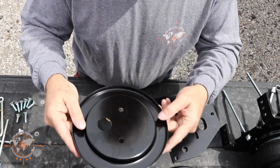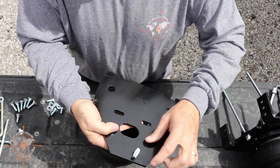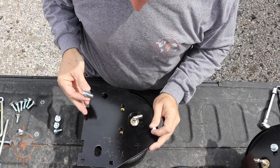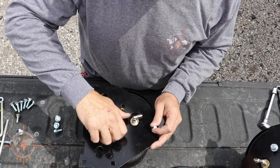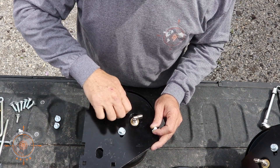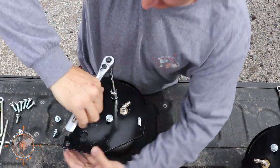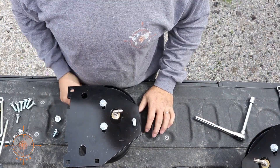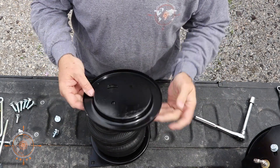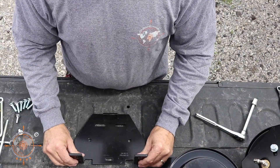We're going to add this plate, then add a hex bolt. We've got our carriage bolt — we're going to line these up with the holes and add our fine-threaded bolts. Now this side is complete, so we're going to flip it over and install this top plate. Set this aside for a second to assemble our bracket.